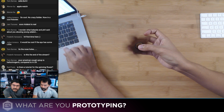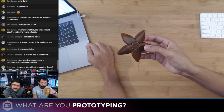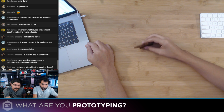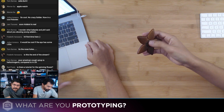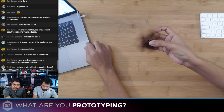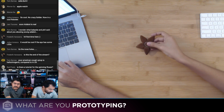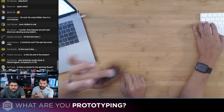And of course, one of the tips, I guess, is to test your tolerances before you print the whole thing. So I printed little rings vertically upwards with a flat bottom so that I could test the tolerances for the diameter of this 608 bearing. We carry these bearings, and I've used it in one project, so I had an extra one laying around. And I figured I'd try to make a spinner, so that was it. Let me show you what it looks like printed here. I think it's so fun.